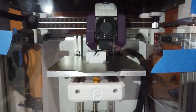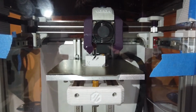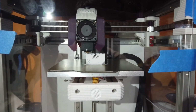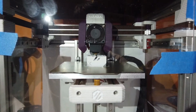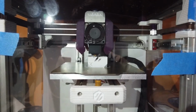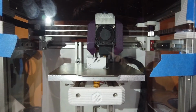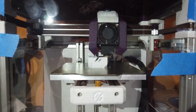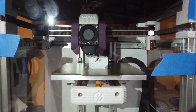This is about halfway through the first print on this new printer. I'm going to probably run a couple more off, but as you can see, hopefully, the default settings are really close. I think I might need to change the infill speed just a little bit, because it's not fusing as completely as I would prefer. But it seems like the pressure advance is okay. I'm not seeing bulging on the corners, and they're not undercutting themselves, so that looks good.